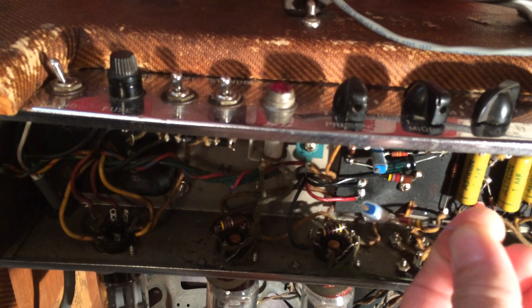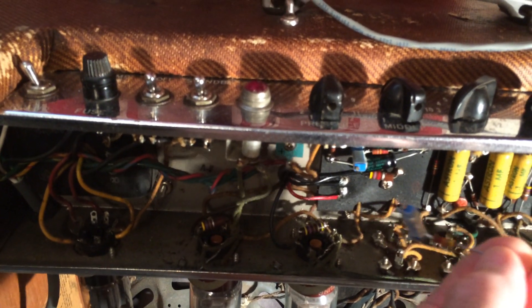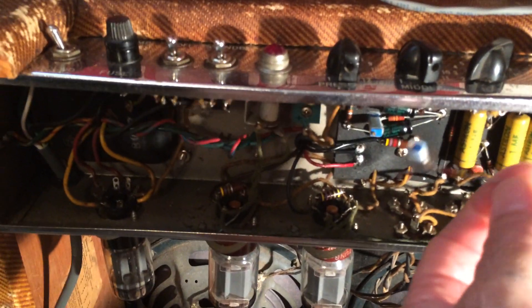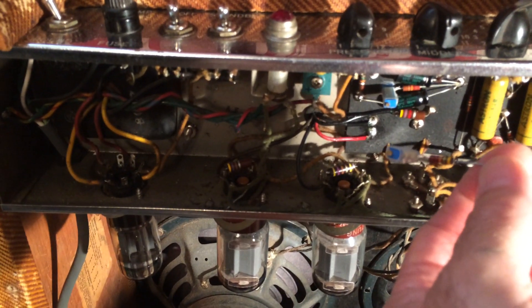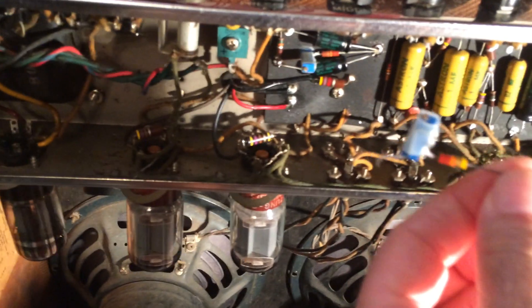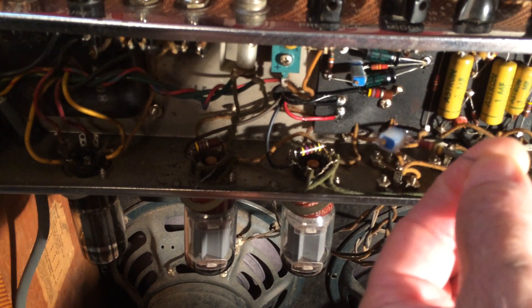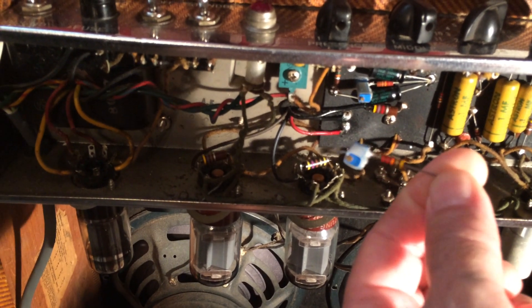After all this, I stuck it in there and started playing. I had it adjusted around 34 millivolts — the tubes weren't perfectly matched, they were at 31 and 34. I'd play it, stop, let it idle, and it'd be at 34. Then next thing I know the bias is at 37 at idle. So I would adjust it down, but the pot didn't seem to work consistently — it would work for a while, and then it wouldn't adjust.